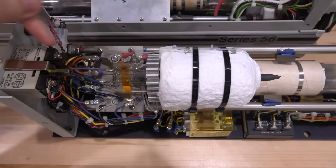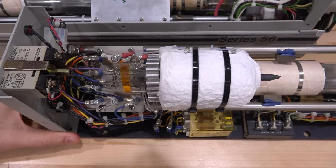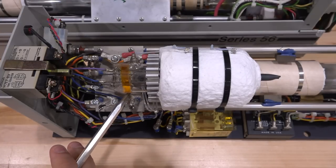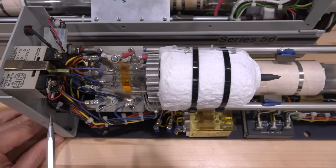Going further down here, which is the cool end of the laser — that's actually where the laser emission comes out. From the other side we have the helium reservoir. There's a closed-loop system inside that monitors the pressure and estimates how much helium is in the chamber, adjusting by allowing helium to flow back and forth from this high-pressure reservoir via a thermally-controlled valve. I found out what the problem with the other one is: there are two filaments — a main cathode and a spare — and unfortunately both seem to have been dead in that laser head.